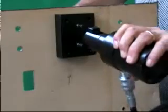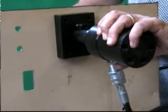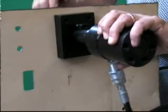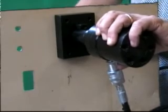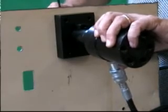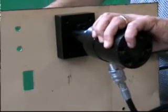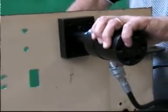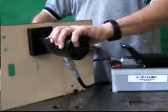And now we're going to present our CYL 205A cylinder with the DD puller adapter threaded onto it. And we orient the bolts, and we use the supplied Allen wrench to bring them up into position till they stop. Always want to make sure that they're both evenly seated so the die draws evenly.